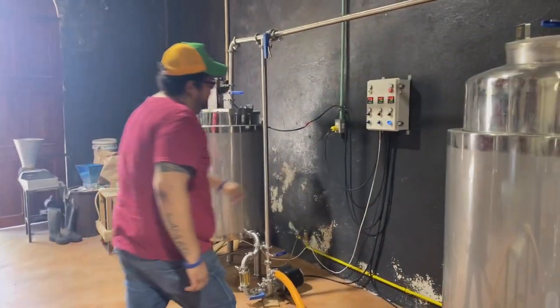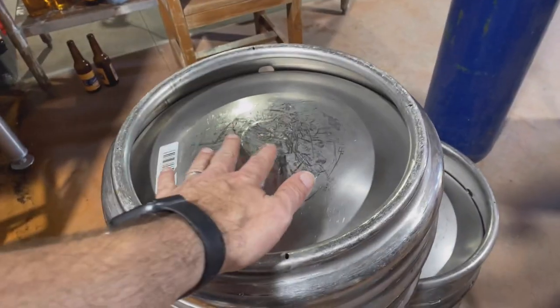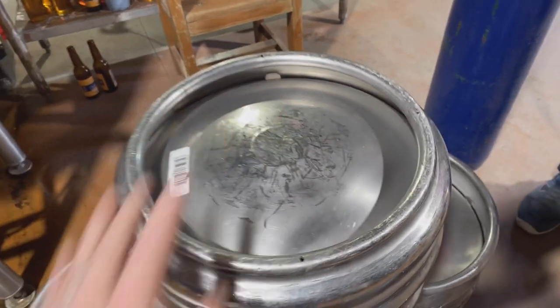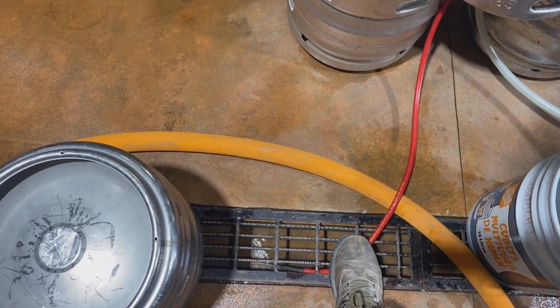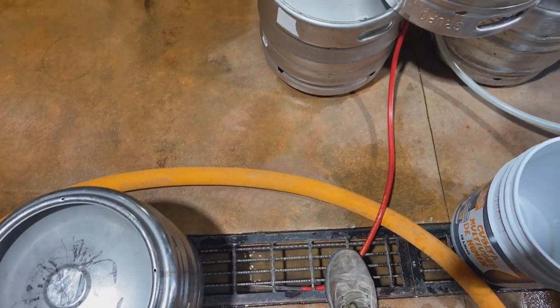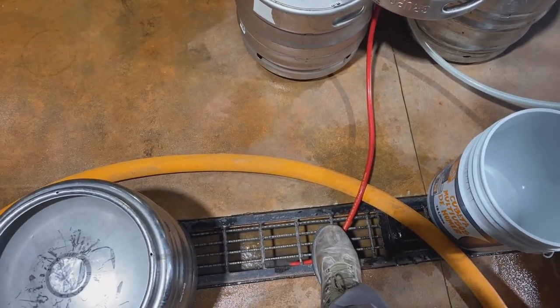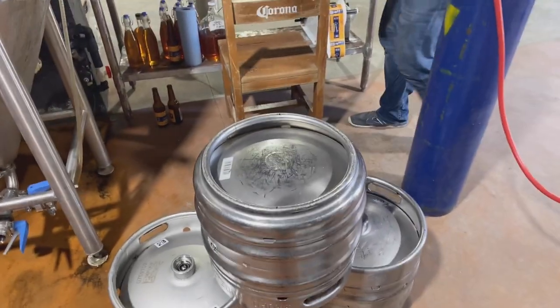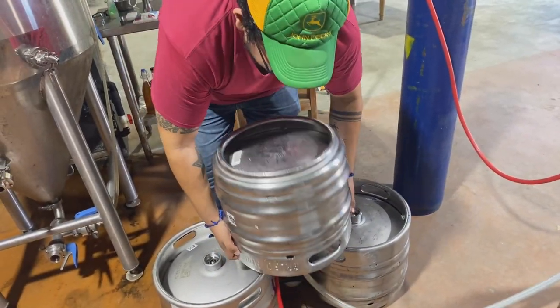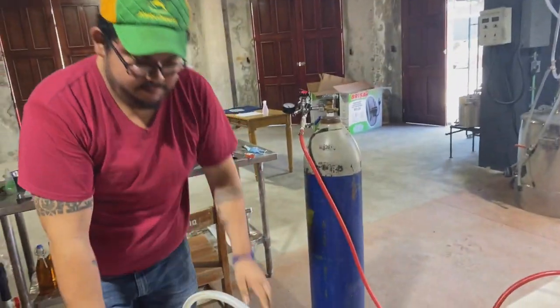To be honest with you, that's probably good — go ahead and stop it. You can see the water coming out. That's enough to get down the top of the keg and the walls. And if you touch it, that's hotter than hell. Go ahead and put the CO2 on — we're going to get all the water out of there. That's good, go ahead and stop it. Now let's go ahead and turn this right-side up. Give it another little squirt of CO2 — I'd like to give it another squirt.